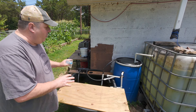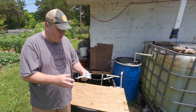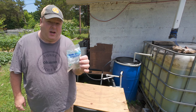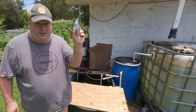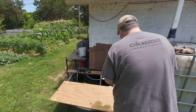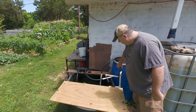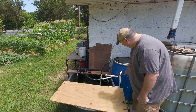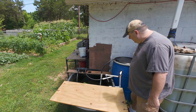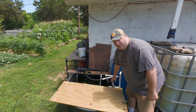I'm going to jump right into it. I don't have a big enough drainage system — that is one of the problems with my own setup. The uniseals at my local hydroponic store were all one size; they didn't have anything bigger than three-quarter inch. These uniseals allow PVC pipe to go into a curved surface, so they work really well on curved surfaces. I've got five uniseals in the system — this one is on a flat surface so I didn't really need it, but I used one anyway.